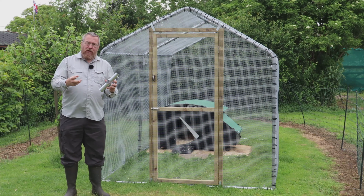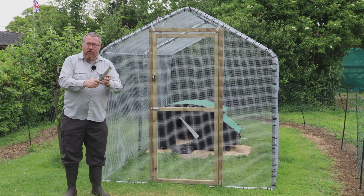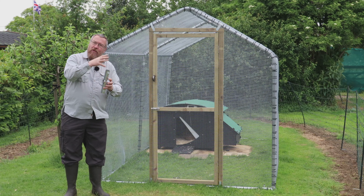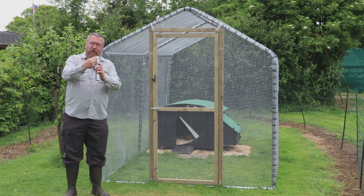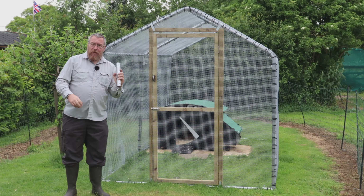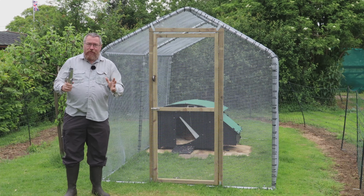And there's two ways of doing it. You can effectively electroplate it, which gives you a thin coating, or you can hot dip it, which is 5 to 10 times thicker, so little scratches don't get through and let the steel rust. That's fantastic. We did note though, that obviously that can get in some of the threads where the bolts go, and we actually had to chase out a couple of the threads with a tap and die set. So that's the downside. But once you've done it, it's really strong.